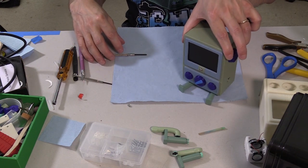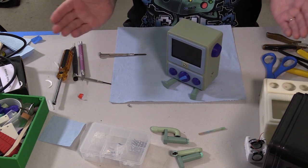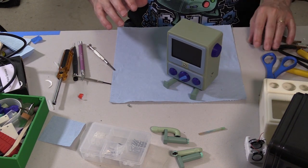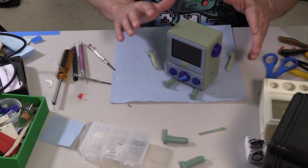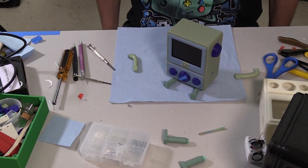So let's boot it up without arms. Now on boot up, the arms will be moved to the upright position. I need to calibrate the servo, so I'm not going to attach them right now. We'll do that a little bit later, but because they'll be off, I need to add some trim controls to fix it. Every servo is a little different. So let's start it up.